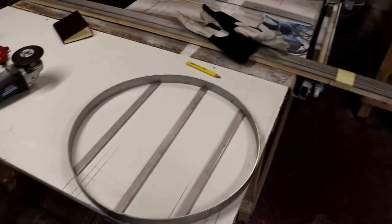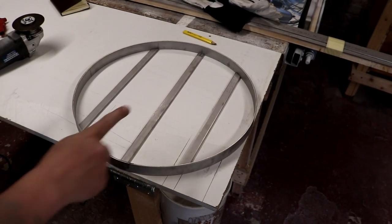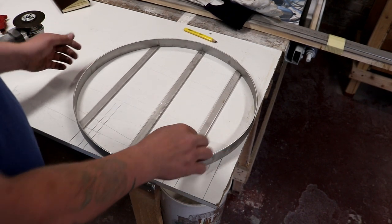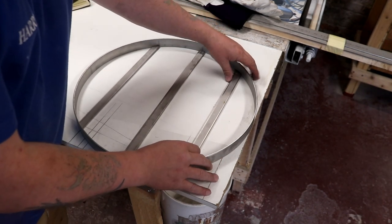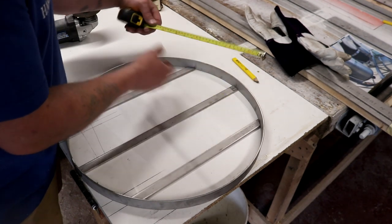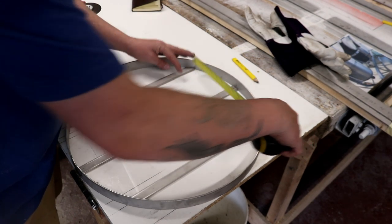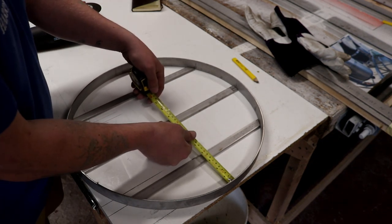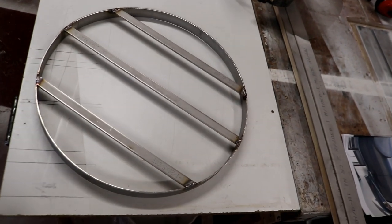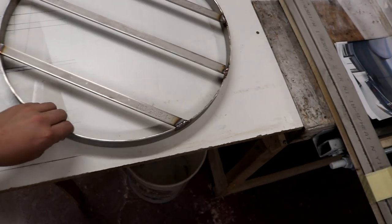I've cut an extra three bars - I've pretty much just eyeballed it and I think that is going to be enough to hold like 100 kilograms, never mind just a pot with maybe 20 kilograms of grain. I'll just eyeball it to line it up a little bit more and then go ahead and weld it on. Happy with that at 85 amps - I'm just going to go ahead and weld it on. There's the finished article - I decided to weld it out seeing as I got going. Can't turn it over yet, it's still red hot. Neat little welds in the corners - I'll probably just hit it with some pickling paste to tidy it up rather than use a grinder, then spray it with water to cool it down.